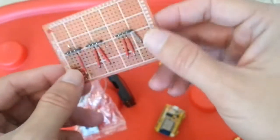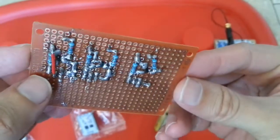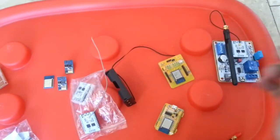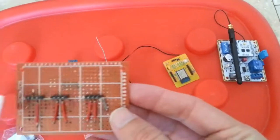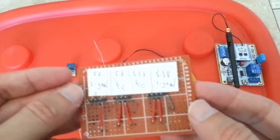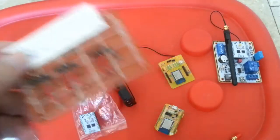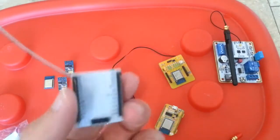They are sorted by price. This is the voltage level converter — it converts a 5V to a 3.3V signal and the other way around. Do remember that the ESP8266 works on 3.3V. It has three separate channels, and each one gets a 5V VCC and a 3.3V VCC along with both of the signals to convert.